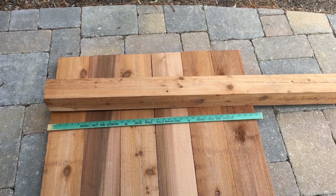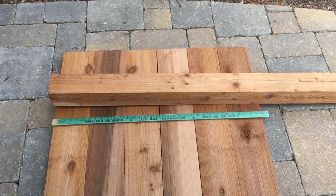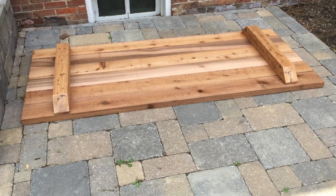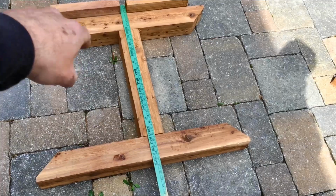So it looks like this dimension is only 35 inches, and I'll cut my 4x4 cross member down to 33 inches. I also clipped off the corners so we wouldn't hit our knees on them. I'll mount those 8 inches in so I can comfortably fit 2 chairs on each side. I want the overall table to be 30 inches tall, so I made a 20 inch cross member.